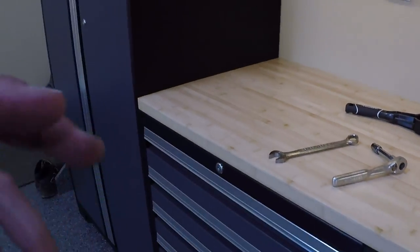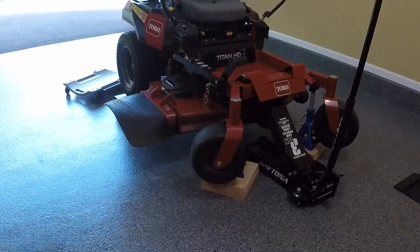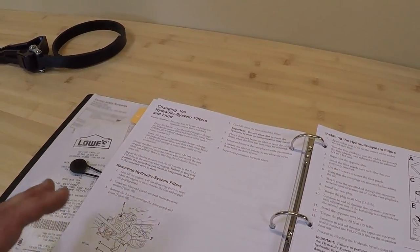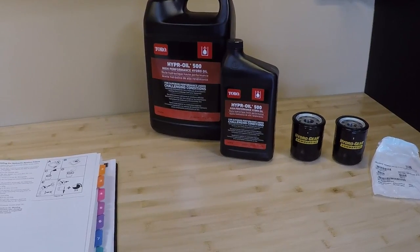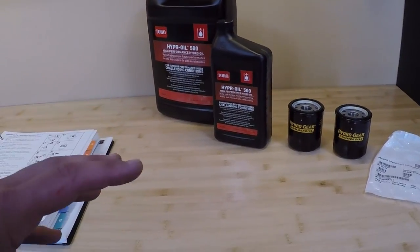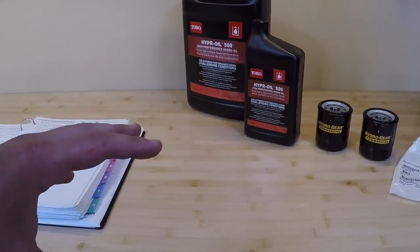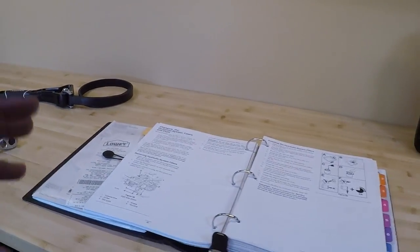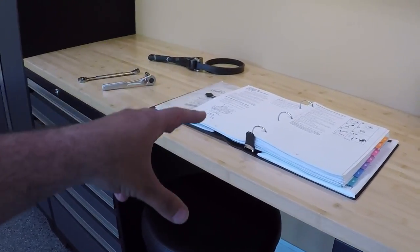This is a ZT3100 on this mower. Some have the fill plugs on the top, some on the side — that can vary. You definitely want to consult your owner's manual. This kit works for the ZT2800 up to the ZT3600, I believe. When you go above that into the 4000 and 5000 series transmissions, it has a cartridge style which is a little different. Hydro Gear keeps it pretty simple with two different styles. If you're residential or even medium-duty commercial, you're going to have this one. The really high-end commercial with cartridge filters — like the 4400 and 5400 transmission — would be a different kit.